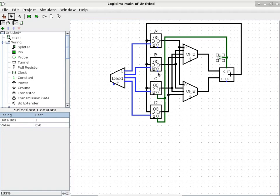In an actual processor, you would hook these up to a single global reset line of the design, so that when you assert the reset pin of the entire computer, not just the processor, everything gets cleared. But in this particular design, we are not going to do this because we're going to inject values into the registers when we need to test the design.